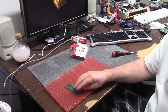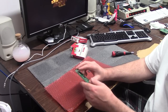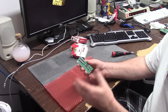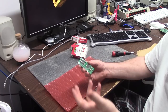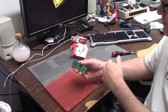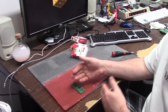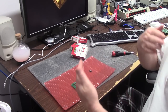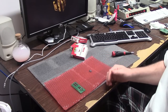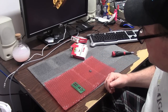retargetable graphics ability. Also, virtual SCSI disks for use with RDB disk images, physical devices connected to the Pi that you can use on the Amiga, like something you plug into the USB probably, or the internal SD card most likely. It also can, in the future, they're hoping to get the networking done. Now, this is evolving daily. The team, you can reach them on their Discord server or through the GitHub page. There's a link to the Discord server, which I will link in the description below.